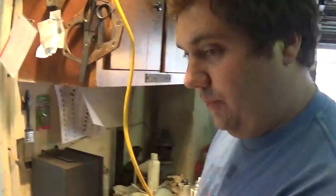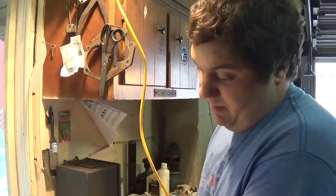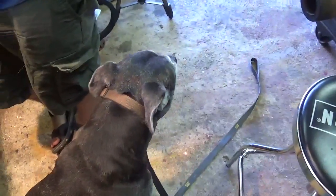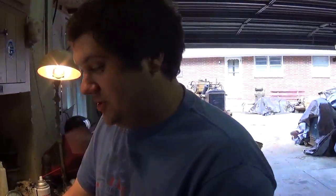I've already cleaned it so there's nothing more I can do. So technically this nozzle needs to be replaced. Since this engine is not going to be used for work, just going to be used for show, I'm quite sure that it would run just fine with a little bit of leakage past the nozzle. I'll keep my eyes out for a new nozzle for it — I've got the American Bosch part number. But until that time, we're going to run it like that. Just wanted to show you guys this handy little tool. Thanks for watching.